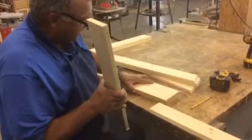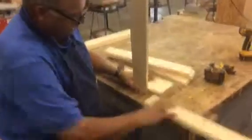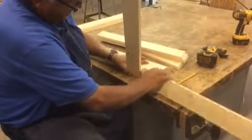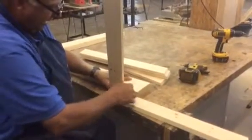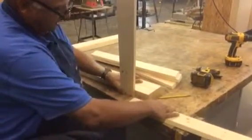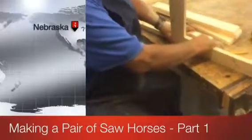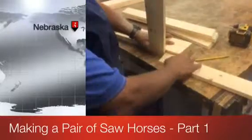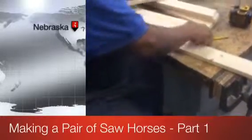So what I do is I lay this thing down here with a wide side up, get my leg so it's flaring out, and I know that that's correct. My apron, I want to have this 15 degree fit right here, and so if that's the case, I need to have my narrow end at the top. So first of all, I need to make a cut at that angle like that, at 15 degrees. Okay, so that's what I'm going to do next. 15-degree cut right here. I've got here just like that, and so it ends up being just like that. Okay, so then my next cut is I need to make a cut right here, and we're going to make that 3 inches from here to here on the long side. Okay, so cut it.